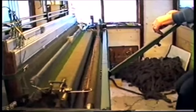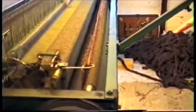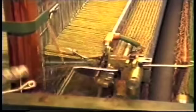The waste is cut off in the middle here. You go along and down into a pile there. The edges are sewn for neatness. They have to be sewn because you don't get a backwards pass, you only get a pass one way. So each edge is sewn with a nylon thread. See the nylon stitcher doing its job there.